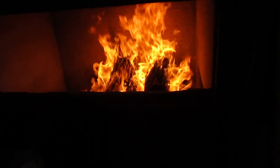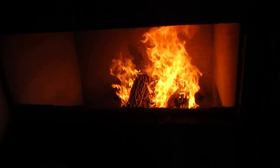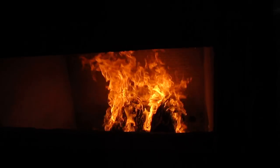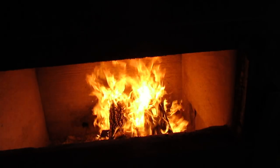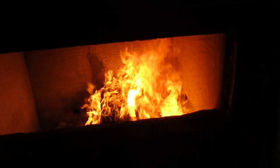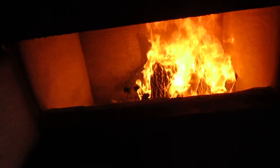There's four inches of refractory cement and two inches of some other kind of insulation. If you wrap your water around the steel around the fire, you're going to get a lot of condensate because the cold water isn't getting up to 200 degrees and the fire is pretty hot. Let me see what happens when I turn the draft on — you can hear it coming up, it'll turn into a torch — and the heat coming out here is unbelievable.